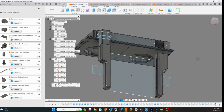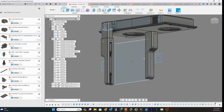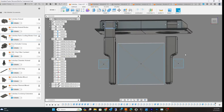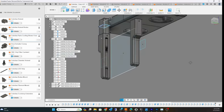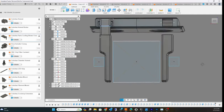This is just my first design, but I want to make it modular so in case this design doesn't work, these little extension tubes are here — I can quickly pop new ones on and try different designs. Depending on what part I'm doing, I might want a more specific cooling pattern, so I can pop these off and put new ones on. I'm trying to make this thing ultra lightweight so I don't want a part cooling fan adding weight to the hot end extruder system.